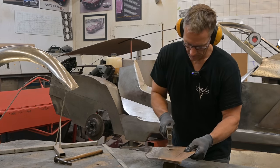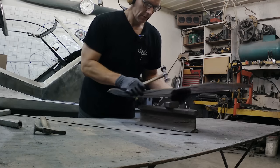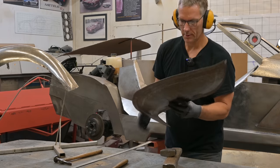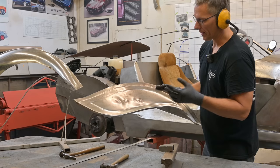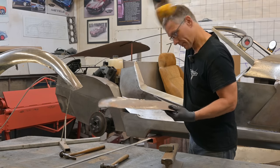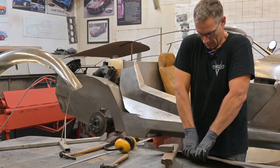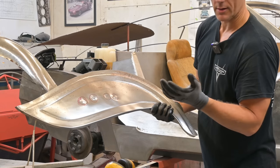Line things up again and strike that down. You can see we still have a very messed up curve. Although we've driven that up, we still have a little bit of material around the perimeter that's puckered. I may have stretched more material than I initially intended to for this demonstration. Let's see if we can oil-can this panel out the other way. Ooh — see how much strength those dents created? If I can reverse that dent like that — what I've done is I've popped this panel back out.